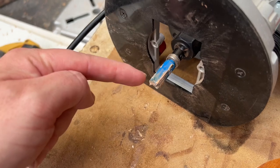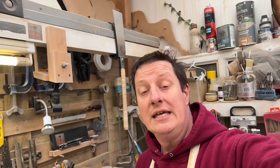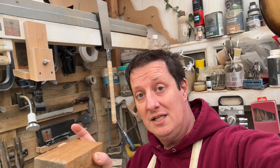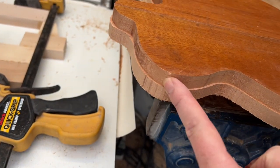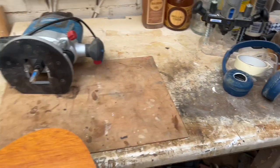After that first run around with the template, we've now got two options to finish off the rest of this thickness. One is to change the bit on the router so that we have the bearing at the bottom, then flip this upside down to copy that shape. The other option — and the one I'm going to go for — is to put a block underneath with masking tape and super glue so I can stick this in the vice. That way when we go around and trace the area with the bearing on the router, the bottom of the bit can poke out and it doesn't just rip all hell in your workshop.